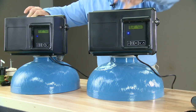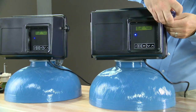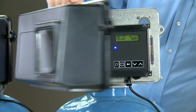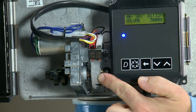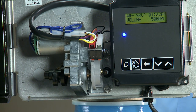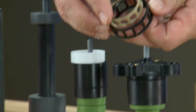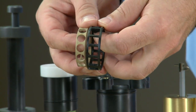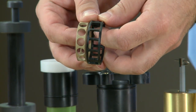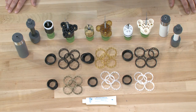You can also identify a unit by loosening the cover. The 2850S will have a gray cam, whereas the standard 2850 will have a blue cam. The components inside the 2850 and 2850S are different — the diameter between the two is a different size as well as width. So we need to make sure when we do replacement parts, we select the right kit.